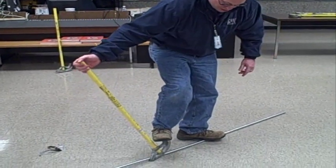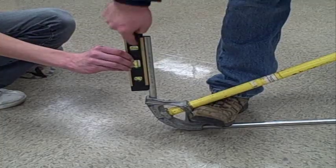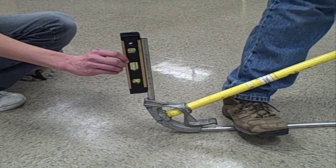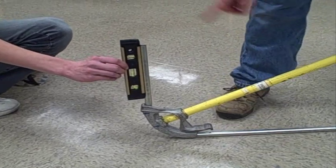Remember: once your foot is on here, you don't take it off. And you keep bending. I see the bubble is right in the middle, but if I let go, there's a little spring back. Looks good, though — that is a good 90-degree bend.